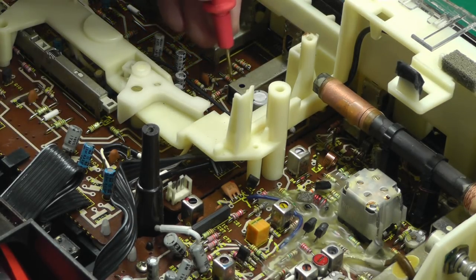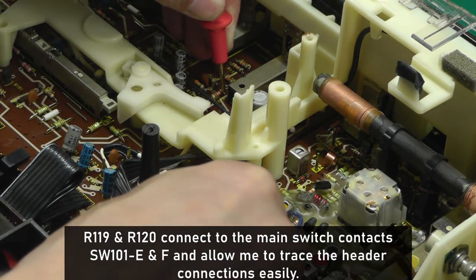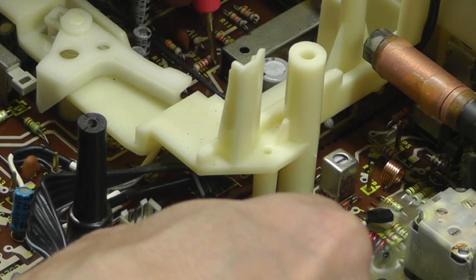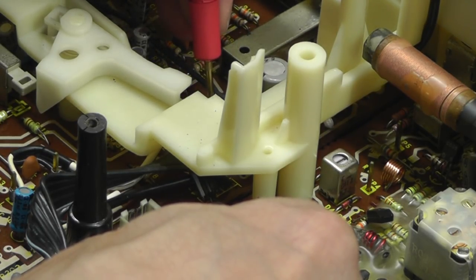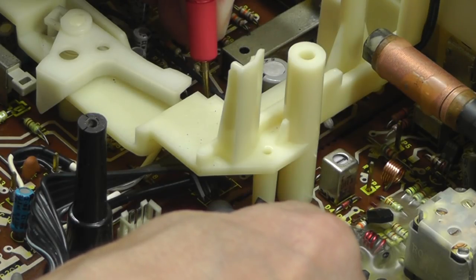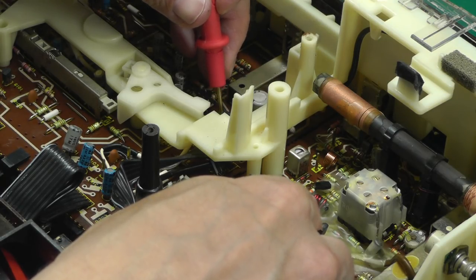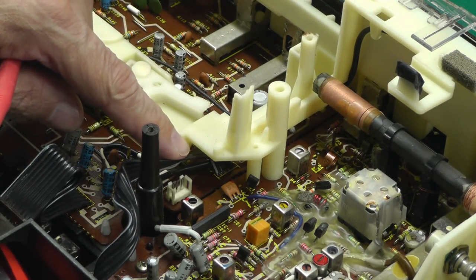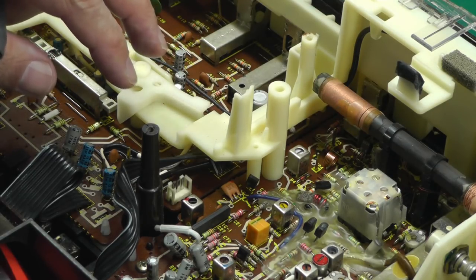I probed along the pins to find R119 and R120. There are five wires on that header, and going from the back to the front, the second pin in is R119 and the adjacent one is R120. It's the second and third wires on that header going off to the radio board — those are the two I need to remove. But before I do, I want to scope the signal and check the voltage levels relative to the Bluetooth module output.